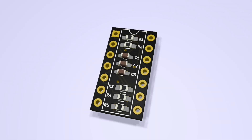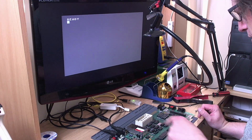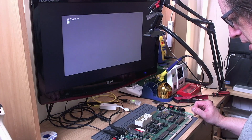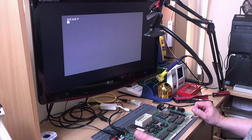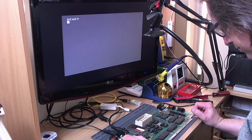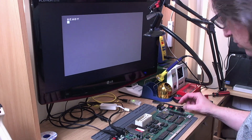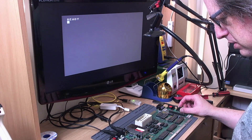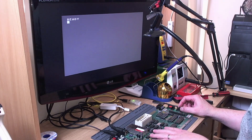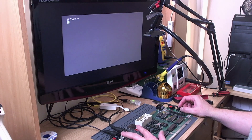There's a link to a project where someone has made a small drop-in replacement - just a few resistors and surface mount caps - which does the same job as the delay line chip. If it's not that and it's not the CPU, it's probably going to be the RAM. I would have brought out Syscheck at some point and plugged it into the PBI connector to see what was going on, but the thing is entirely socketed anyway. If you've got a machine with known good ICs or some brand new parts, it shouldn't take long to find out what the problem is. The upgrades may actually warrant a video of their own - I don't think I've put Sophia into a 600XL on video before, so I might actually make a video about that.